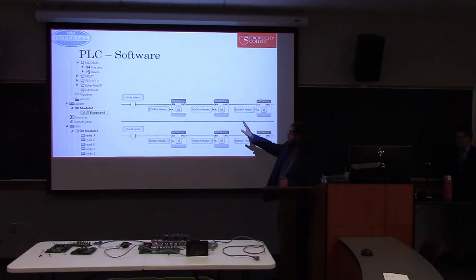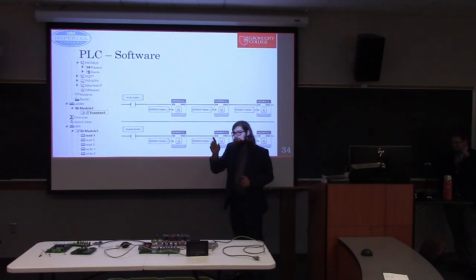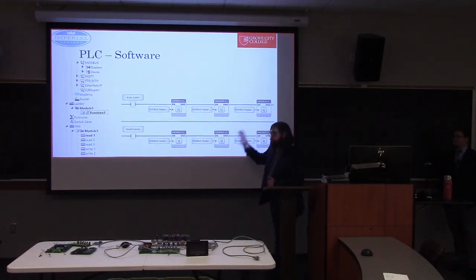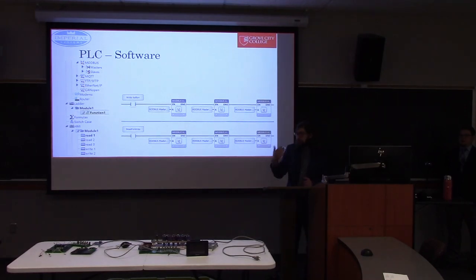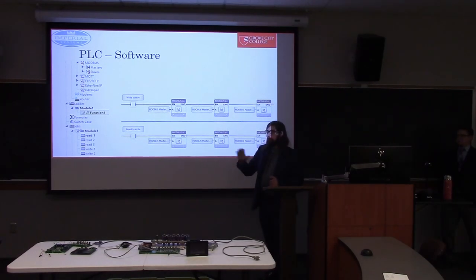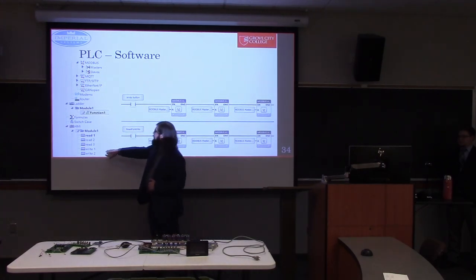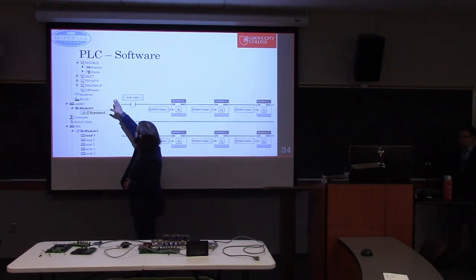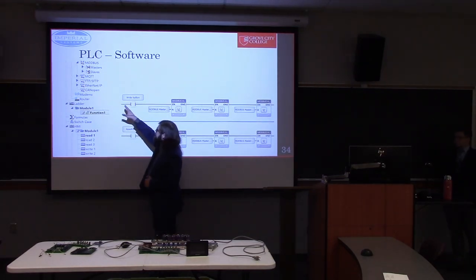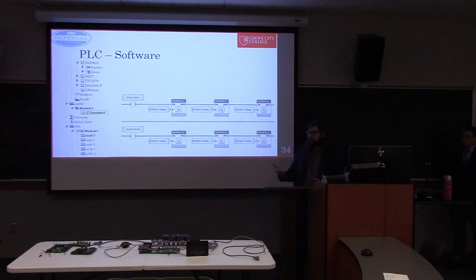This is the actual ladder logic. We have a button as a direct contact, and when you click it, it reads down each rung. This is a write rung — if you type in some numbers and press the write button, it goes down and updates all of the registers on the microcontroller. This is for a read-write — when you go to write, it first reads all the registers to see what you want to change. On the left are the Modbus Master and Modbus Slave functions, which are very easy: you simply specify the register you want and whether to read or write to it.